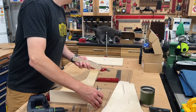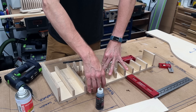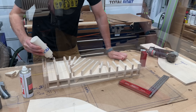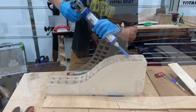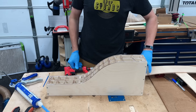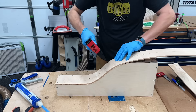When I got into building the bending form frame, I realized I didn't need two internal layers - just a top, a bottom, and some middle supports. But overbuilding is what I do, so I used CA glue to temporarily set the pieces, then wood glue between the layers and brad nails to secure it - strong enough to hold a car. Then it was time to glue on the quarter-inch bendy plywood using Thixo epoxy, spread around evenly, and a staple gun to really secure it, since staples provide better surface area clamping action than brad nails.